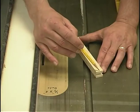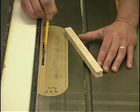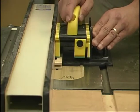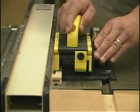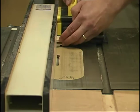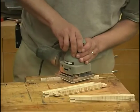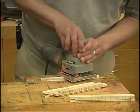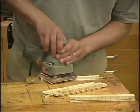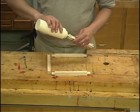The last step before assembly on our door is to cut the grooves that will receive the inlay — those grooves go on the styles. I'm using a quarter-inch stacked dado head cutter raised up an eighth of an inch and set an eighth inch away from my rip fence. I'll have to make that cut in two passes, going in each direction, and then we'll have our half-inch wide groove. Before assembling the door components, take your time to sand up the inside faces of each of the four pieces — it'll save you a lot of grief later on. Then we can go ahead and glue everything together, using yellow woodworking glue. Clamp up your frame with a light touch and check it for square — you don't want this door to be out of square. A moment or two with a good sharp chisel and we can square up these corners easily.